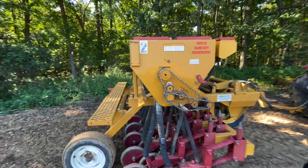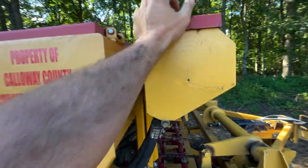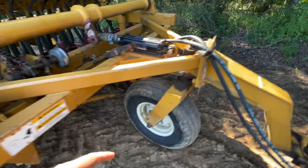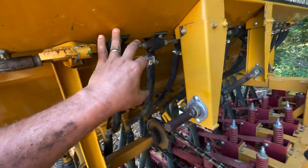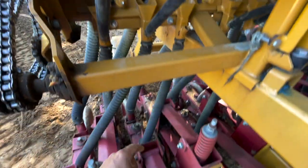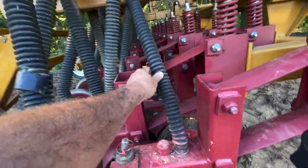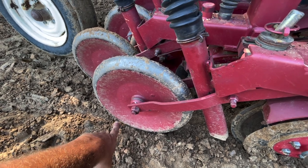On this drill, you've got different seeding boxes — your big seed box for oats, soybeans, winter wheat, and then your front hopper which is for alfalfa. Open it up and you can see the purple seed inside. There's a seeding chart right there where you adjust the rate — you just move that left or right. Here's your ground drive: if that's not spinning, you're not planting. You can see all these little hoses — these are coming out of your small seed attachment where my alfalfa is. The problem I had earlier was this hose here had a cobweb right in it. I started at the bottom pulling hoses, didn't find seed, came up, opened the hose, and that's when I found the cobweb. The meter turns up top, drops seed in, it comes right behind the double disc openers, drops it out, and then the closing wheel closes right behind it and presses it back down.